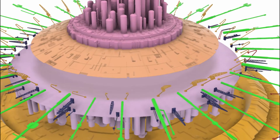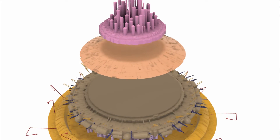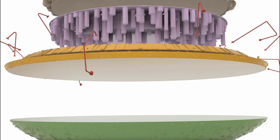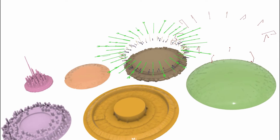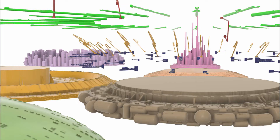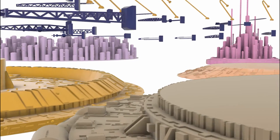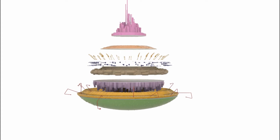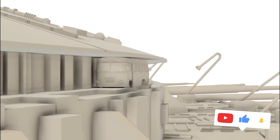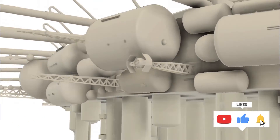I segmented this model at natural break points, and the parts mostly feature flat bottoms. This will allow you to easily orient the models for FDM printing flat on the bed. The upside-down city has a key for the central column to help with alignment. The widest single part of this model — the bottom mushroom hull — has a default scale of 347 millimeters. This is the measurement without antennas, but the model can be upsized or downsized in your slicer software. Depending on how large you plan on printing, you can easily hollow the parts in free programs such as Meshmixer to create shelled parts that can be backlit with LEDs. I'll have a future video demonstrating this technique. This STL model is currently available through my website.